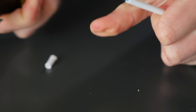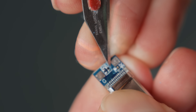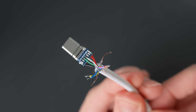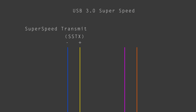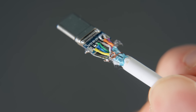The first thing to do is actually chop the end off. Now this might seem a little bit extreme, but it's the only way to access the wires, of which, as you can see, there are twice as many. This is because it has two more data transfer wire pairs, like I mentioned earlier, which are yellow and blue, and purple and orange. Everything else about this conversion is the same as the previous two, so after changing the resistor and soldering in place the power and data positive and data negative cables, it can technically work as is, although only at the slower USB 2.0 speeds. To get this thing running at full speed, we need to solder the extra wire pairs in place. As this is acting as a sub-device, blue-yellow function as superspeed transmit, and purple-orange function as superspeed receive. Basically this means purple goes to B10, orange to B11, blue to A3, and yellow to A2. Any open ground wires can be twisted together and connected to the ground pad.